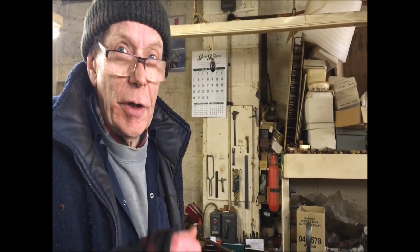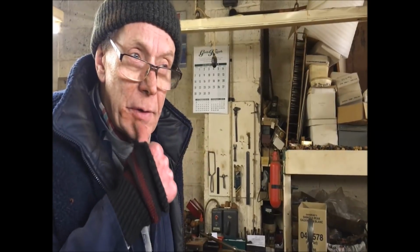Yeah. If that sort of heavy kickback that you get on the chisel is standard fare, that's heavy going. I mean, that takes getting used to. I suppose it's a question of adapting to the machine. I don't think there's many people use the method we use for the hand turning, but generally speaking, the tool rest is usually on the same level as the centre of the lathe, of the chuck. Right, okay. And quite close to the work. Yeah.